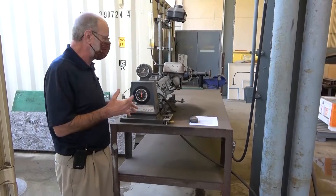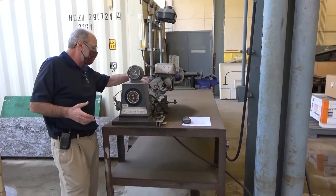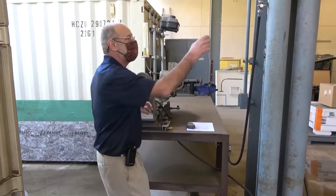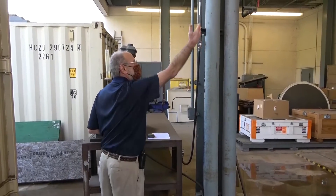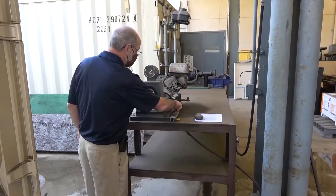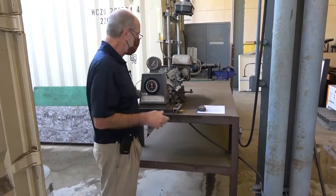The first thing we always want to do is make sure we have our water supply to the dynamometer. This is a water brake dynamometer — there's a very small water brake right here. We turn on the water supply from the building by turning the valve handle in line with the tube, and then the second valve gets turned on the same way. That provides water, but this control valve is what we'll actually use — we won't provide any water until we're ready to run.